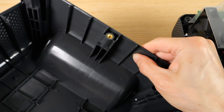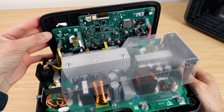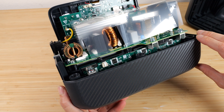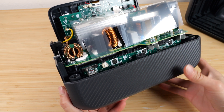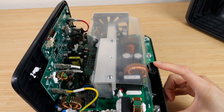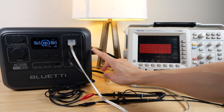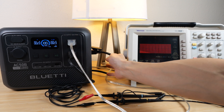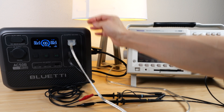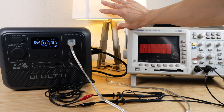The plastic is very thick. The circuit boards are nice, clean, green, and shiny — they have their own logo so they designed their own boards. The batteries are all contained in the lower one-third so all the weight is towards the bottom, giving it a lower center of gravity. There are large inductors inside. This power bank can work in UPS mode, which allows you to turn on the AC so all power comes from the grid without drawing from the battery — and if you pull the plug it'll quickly switch to battery power so the power to connected devices is uninterrupted.